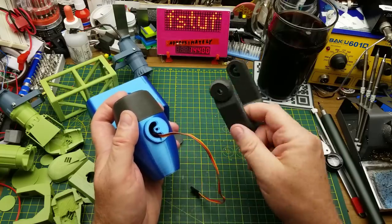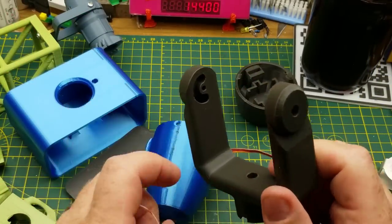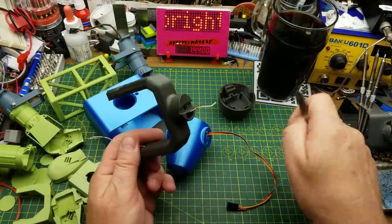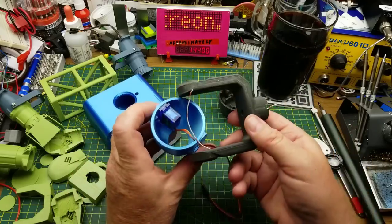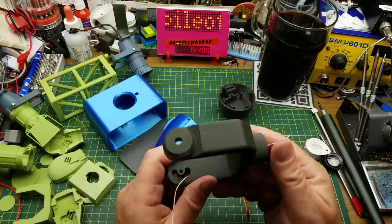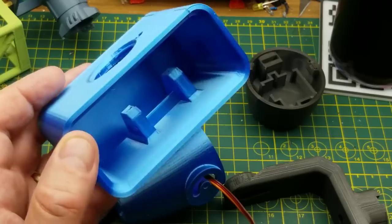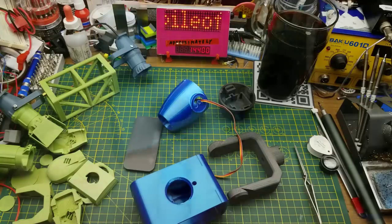The wire goes out the side there, and this is kind of clever: on the side of the yoke there's a little crescent that matches up with another crescent there. The side of the yoke is actually hollow, and that hollow spot comes down to here so you can run the wires through. Since these servos only move through 180 degrees, that should in theory not pinch off the wires — pretty clever. Down in the base there's another mount for a servo and a little cutout for the wires to stick out. There's even a hole for a screwdriver; whoever designed this has thought things through fairly well.